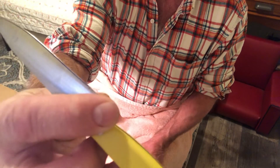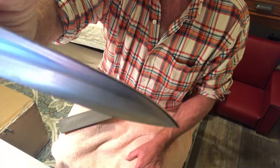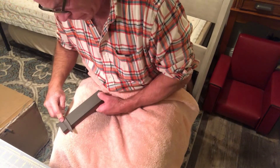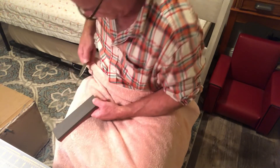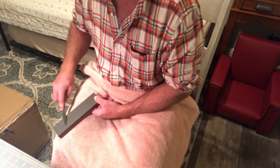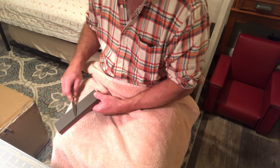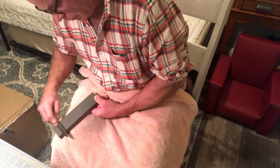Now you should be able to see a shiny line, a consistent shiny line on that cutting edge. If they're still black, that means you've missed a place. Keep on honing until that's totally consistent. If you go down and you see that they're still black right here, that means it hasn't touched the stone because we're still going up here. We've got to get our elbow to go down. And if you get there and still can't do it, start pulling the handle down — let the tip go up. That will get every part of that cutting edge.